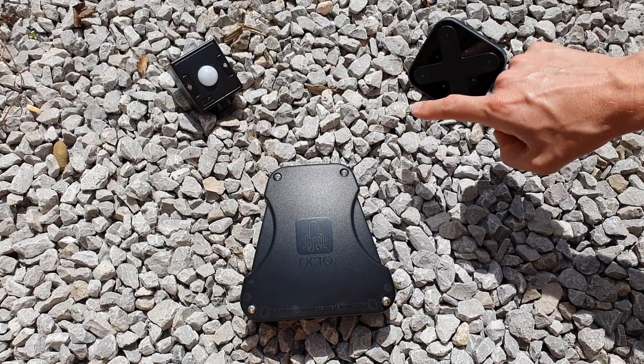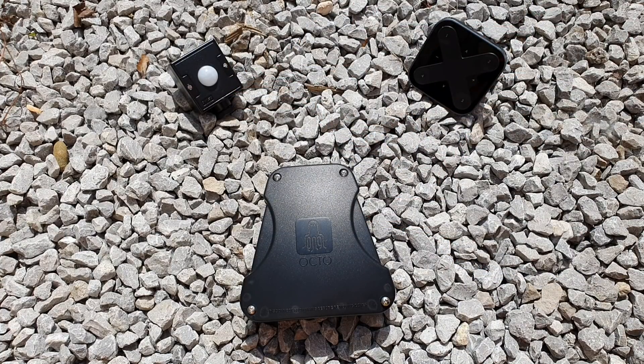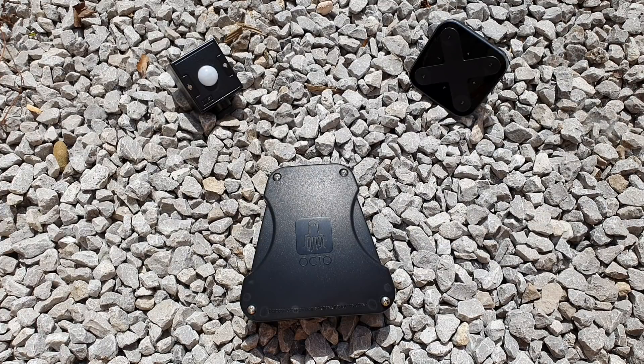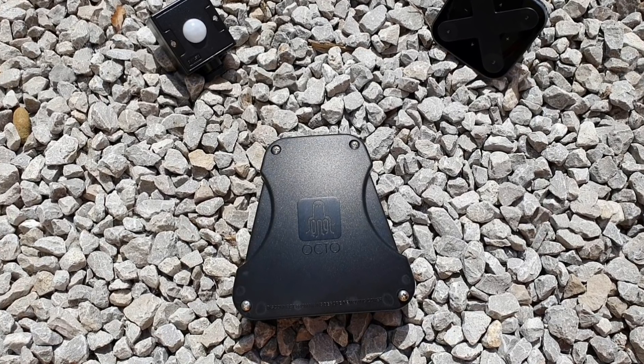These devices all connect to each other to form a network, and within that network you can have up to 127 devices. However there's no limit on the number of networks you can create within an installation. Each device has a Bluetooth connection inside it, giving you a 15-metre operating range per device if mounted internally, or a 30-metre range if mounted externally — bearing in mind that will vary depending on obstacles between each device. Because this system relies on Bluetooth connectivity, if the Wi-Fi connection inside the property goes down or you lose the internet, the system will continue to operate. As long as you have a Bluetooth connection you can continue to control the system from your device or the connected switches and sensors.